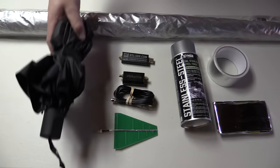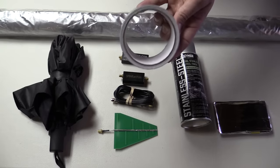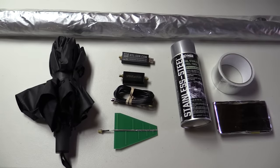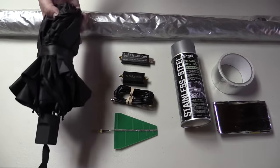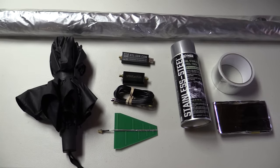In the original video I used a cheap umbrella covered with foil tape, which took multiple rolls to cover entirely. That worked pretty well, but the downsides were that you couldn't fold it up again once it was covered — it was locked into place. It was fragile, blew around in the wind, and fell apart after a while. So while it worked as a field-expedient satellite dish, it wasn't really a long-term solution.